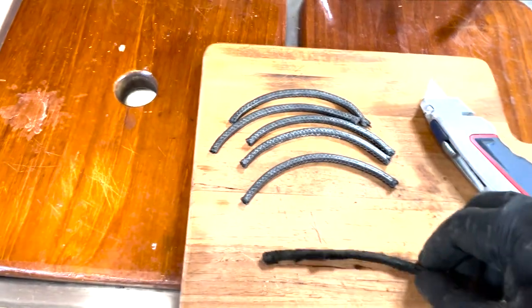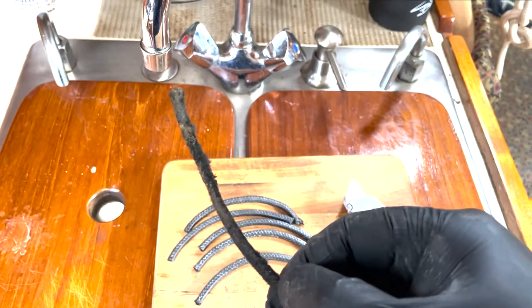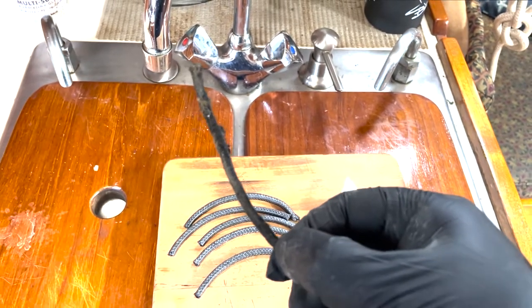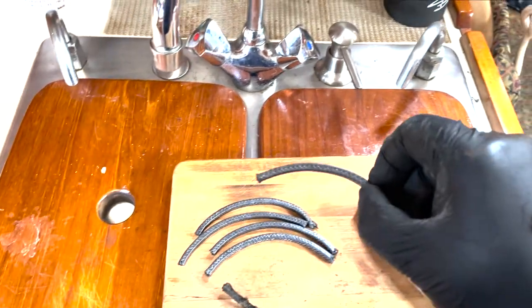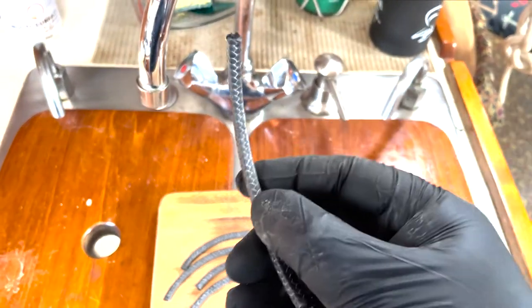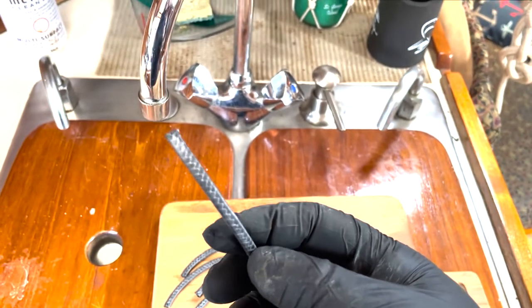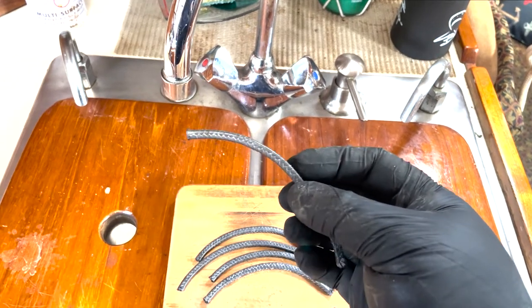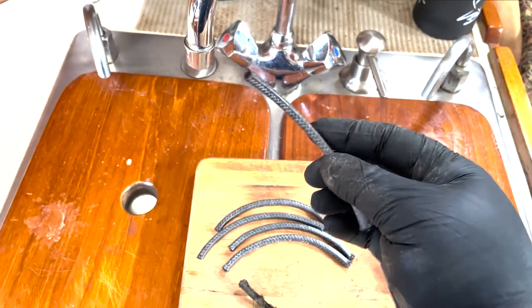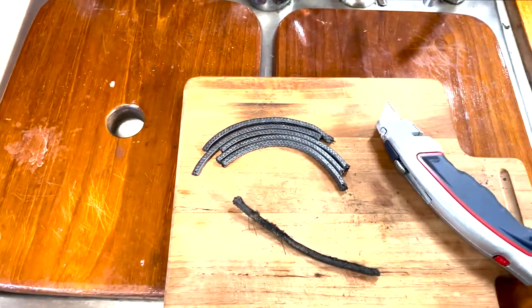And you can see this one, if you look closely, I don't know if it'll focus, is frayed, so it definitely needs to be replaced. There's barely any wax left on it. So these guys, I used them a lot with the last job I was at with our hoist, through-hole hoists, and they're graphite packing flax, and they're supposed to have less wear on the shaft and better sealing properties and all that good stuff. So I'm going to put those in.